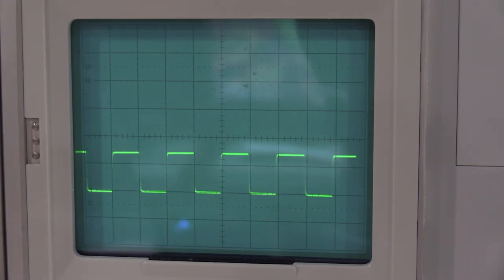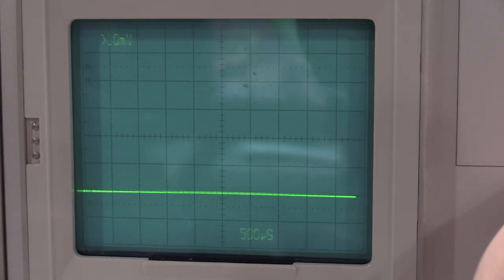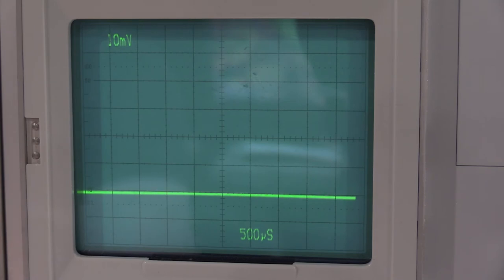And we go on to step 5, which is just checking trace identification. So I have to turn the readout on for that. Put that back in. Push the identification button. And that's unfortunate. Nothing's happening on the identification, so it's another thing we'll have to troubleshoot.